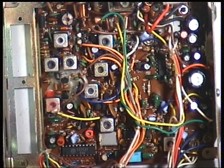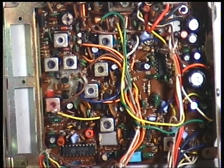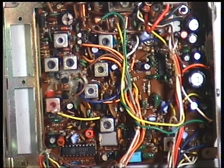Into the Maxcom 6E for the receive part of the setup. It's as deaf as a post. That's 3 microvolts at the moment, and that's as good as it will receive at. So whether or not there's a fault, or whether it's just a tune-up, that's what we're going to find out. It's certainly totally unusable, as deaf as it is.